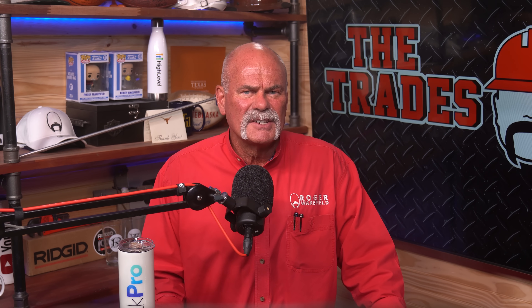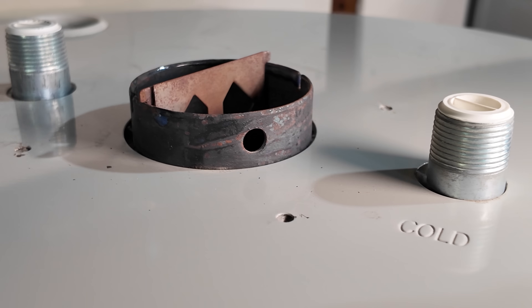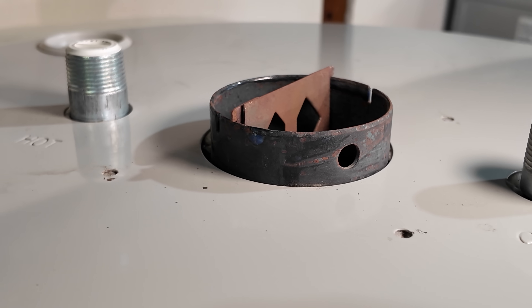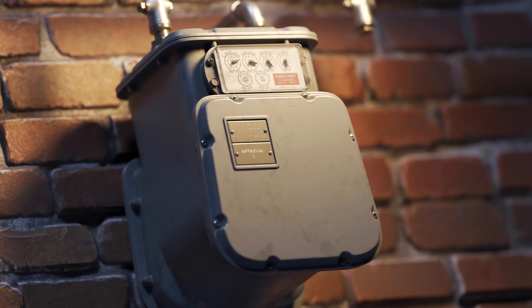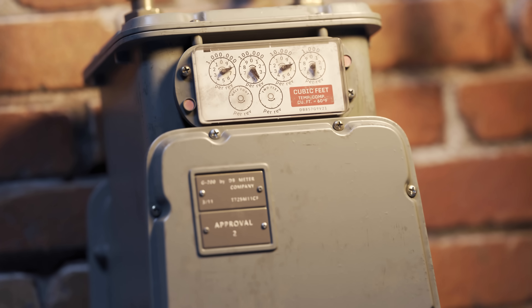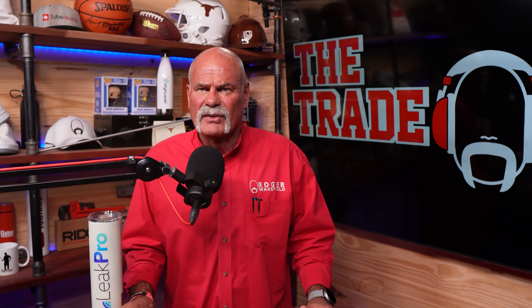Remember to ensure proper ventilation during installation and testing. That way, if there is a gas leak, it doesn't affect anyone. But if you smell gas, stop what you're doing and evacuate. Open up the building, air it out, get as much fresh air in as you can. Then, if you need to, go out and shut the gas off. Before you ever start working on your gas system, you need to know how to turn it off. If you can't or you're not sure where it is, call the gas company or emergency services. Never attempt to repair a gas leak yourself unless you're comfortable, trained, and know what you're doing. Gas work is dangerous — sometimes it's best to leave it to licensed plumbers.